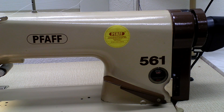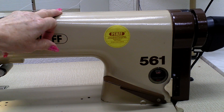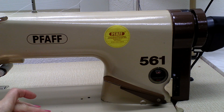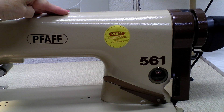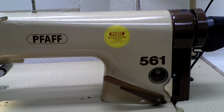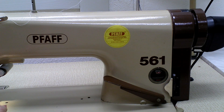Most industrial sewing machines have the same system for filling oil. But if you have a much older model, you might find on the top or behind on the machine head some more holes. These holes do not have a winding inside — it's just a hole, not for putting screws in or fastening anything. Those holes on elderly machines are also for oil, but they are only meant for just one drop occasionally, because there are certain moving parts not supplied by the main oil tank. So occasionally, just drop one drop of oil into those holes and you're on the safe side.